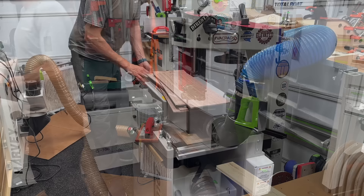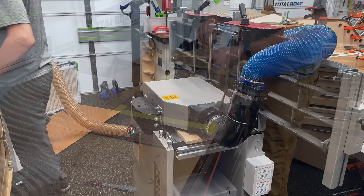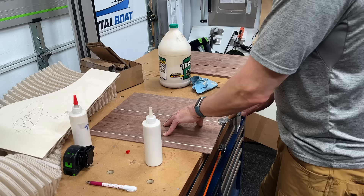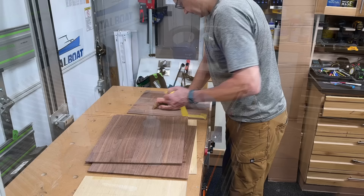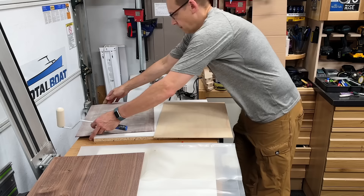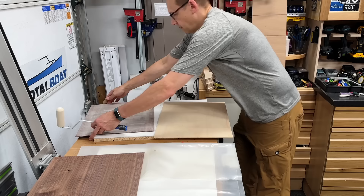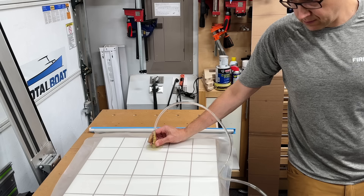Before the actual glue-up, I worked on the drawer bottoms, starting with re-sawing some walnut and running it through the planer down to about an eighth of an inch. To make wide enough panels, I used tape to join pieces - two pieces together weren't quite wide enough, so I added a little strip on the end. A stripe of glue, wipe off the excess, stack them with kettlebells on top for about half an hour. Once dry, I removed the tape, spread real glue on the walnut and the quarter-inch core of the drawer bottom sandwich, rolled it on evenly with a foam roller, added green tape on one edge to prevent sliding, stacked them with wax paper between so they don't stick, and slid them into the vacuum bag. Turned on the suction, marked the time, and left them in for about an hour or two.